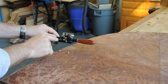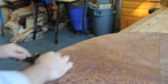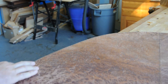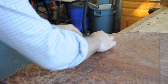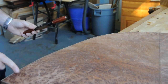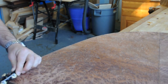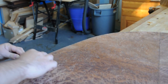I'm using the side of the blade over here to get me down. Nice sharp blade. And you can hear when you start to get closer, because the tone is changing - it's vibrating less, because you're further away from the surface. I want to be careful when I get to the edge here that I don't cause this to splinter off. It takes very little cut here.